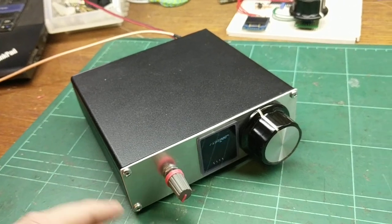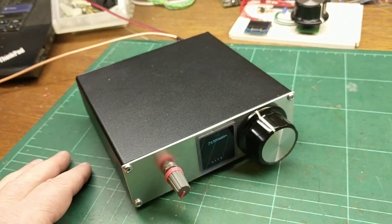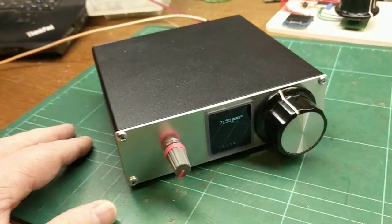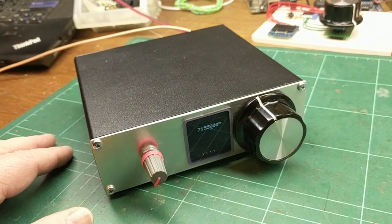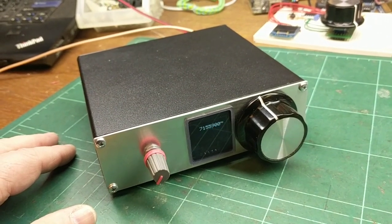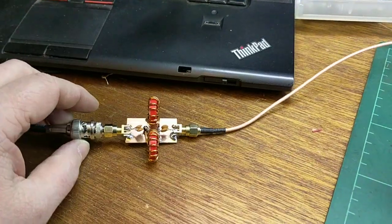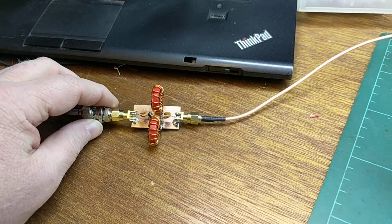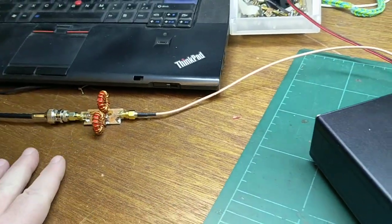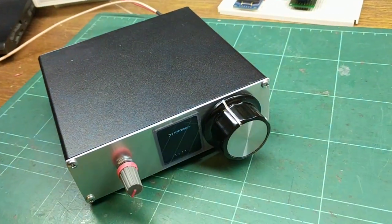Realistically, it would make a great little portable radio for carrying around in a backpack — you just need a 12-volt battery. At the moment I'm using a 21-meter length of wire on a couple of poles out in the yard. I do actually have a high-pass filter to block out the AM broadcast band. I get a lot of harmonics and stuff in the radio because I'm obviously pretty close to a repeater in town for the AM broadcast.